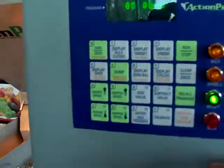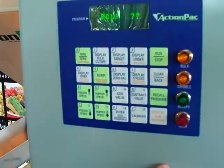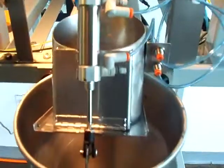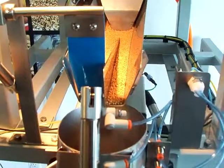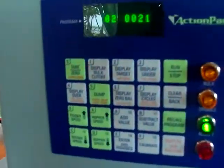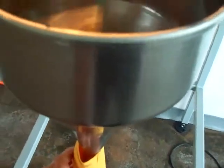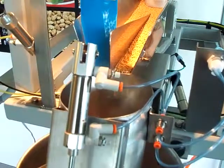To change your weight, stop it so you're not in run mode, then recall a different program. I've set up program 02, so you recall program zero two, place your bag under the funnel, dump it, and then start. This weighing is a little slower, and you'll see on the screen — exactly two grams. I have this cycle also re-zeroing every time just to ensure perfect accuracy.